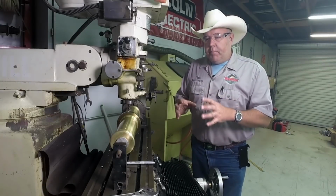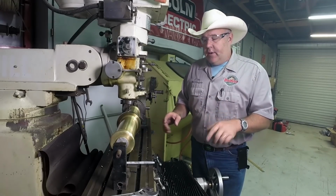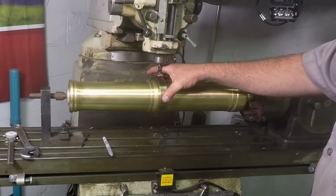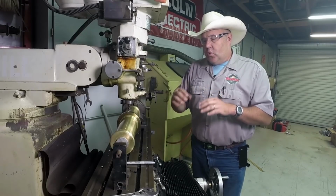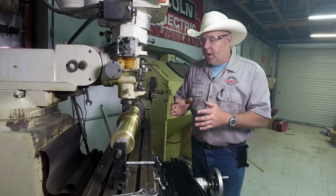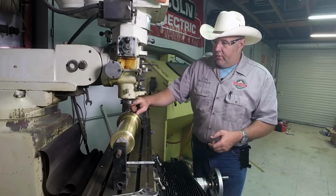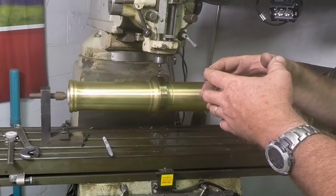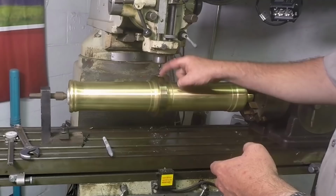All right, we just got a couple more machining operations to the barrel before we put the final polish on it and call it done. One of these is this trunnion ring that we've made and shrink fit on there. I'm gonna bore this into the barrel about 230 thousandths. A little less than a 1/4 inch, but that still gives me right at 7/8 barrel thickness, which is 7/8 to 1 inch, what we wanted. And when I bore this in here, I'm going to machine a pin that's going to come out, this trunnion pin. What it allows is, if that shrink fit ever gets disrupted and doesn't work for whatever reason, that trunnion is pinned to the barrel and through this, so it can't ever come out.